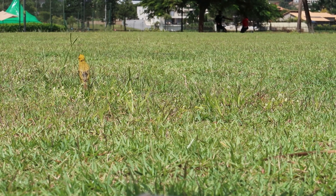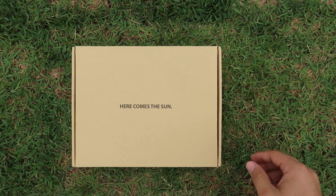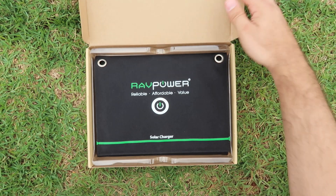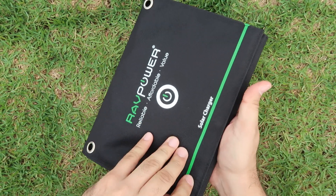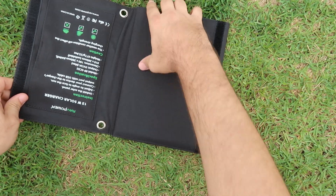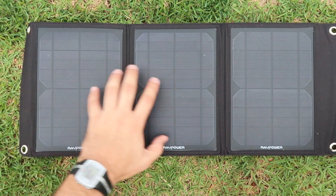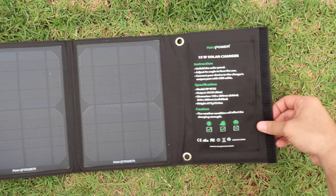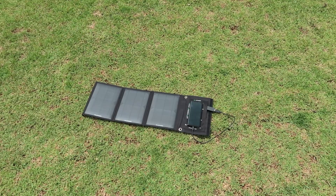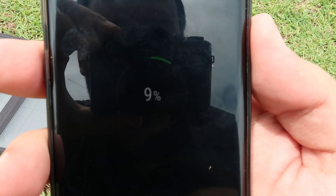A few days later, I went off with a different purpose. I wanted to see how my portable solar panel would behave in a similar situation. Mine was a 15W portable solar panel from RevPower, that probably doesn't even exist anymore. I know it's 15W while the hub is only 3W, but this is the kind of solar panel people would use for bike touring and camping, so I still think it's a relevant comparison. Also, that maximum power can only be achieved with ideal conditions, such as direct sunlight with a clear blue sky, and that's definitely not the case here. So I set up the solar panel on the grass, powered my phone off, and plugged it into the solar panel. I started the test at 9% and left it there for one hour.